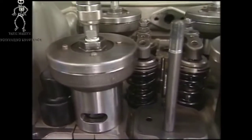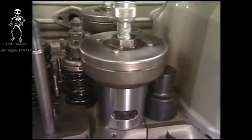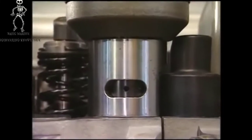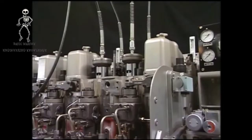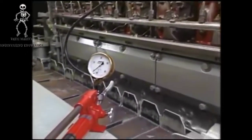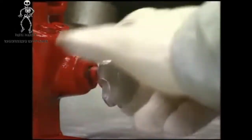After the hydraulic jack is set into the four cylinder head bolts, check again the direction of the spacer. Check that it does not interfere with the tightening nut of the adjacent cylinder head bolt, and also that the hole for loosening the tightening nut of cylinder head bolt can be seen from the clearance of the spacer. This is the end of the work for attaching the hydraulic tool. Before applying hydraulic pressure, check each attaching portion of hydraulic hose, and finally close the relief valve of the hydraulic pump tightly.